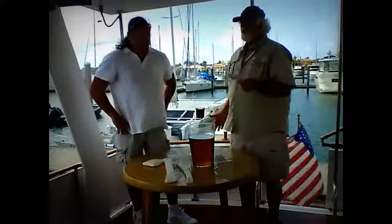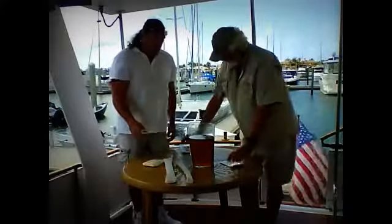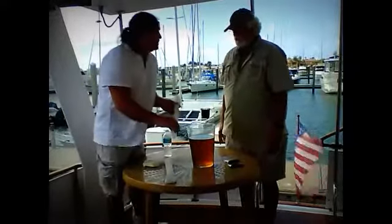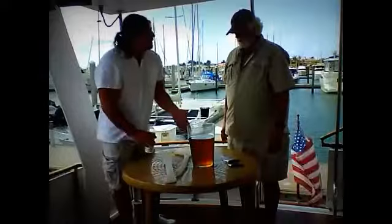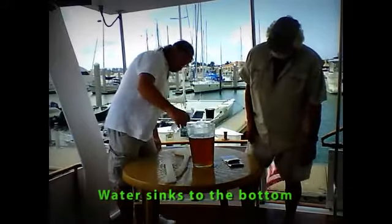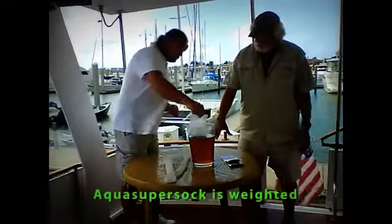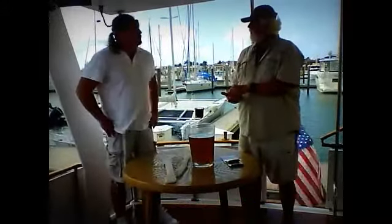You say it traditionally takes 24 to 48 hours — we wanted to go boating today. Is there anything you have that can help me today? We have just designed the new Aqua Super Sock 18, which pulls out 18 ounces of water and will work immediately, probably within an hour's time. If you get it sitting where the water is, it'll pull the water out because of the new mesh material. Here we have about a gallon's worth of diesel fuel. I'm going to drop about five or six ounces of water in there. You see the water's going down to the bottom — that's the problem inside your tank. The water at the bottom is where the fuel gets picked up when you're running your motor, so it's going to suck the water up.